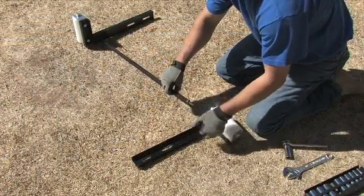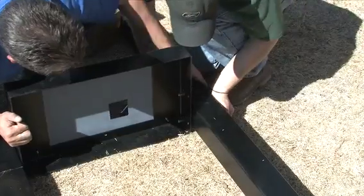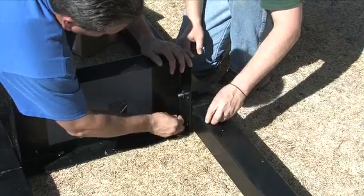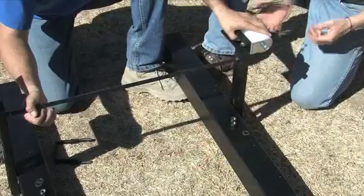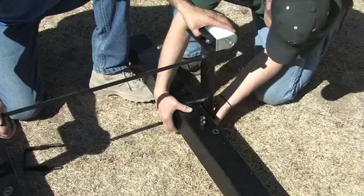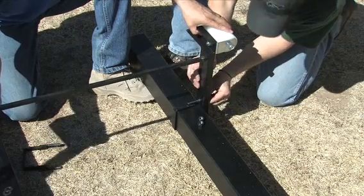Bolt the roller arms and the gate operator mounting platform to the slider guide and leave bolts loose for now. It will be easier to adjust the operator platform if you leave off one of the U-bolts for now. The platform will go 3.5 inches above grade. And in the case of the Essex, the top of the guide rollers will go approximately 59 inches above grade. Double-check these measurements for other gate styles, as they may change with a taller or shorter gate than the Essex.